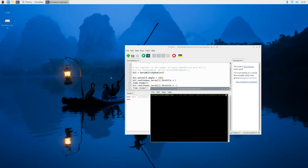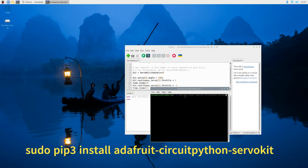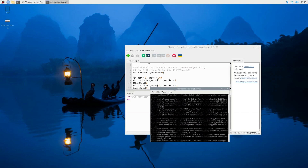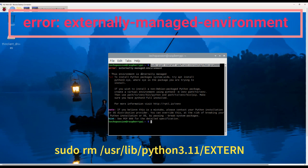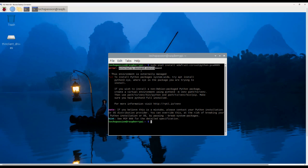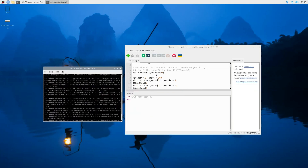I've remote-desktoped into my Raspberry Pi — I'll make a separate video on how to do that. I opened a terminal window and copied the install command from the documentation. Just type or paste that command and hit enter; it will install the library unless you already have it. If you run into an error that says 'externally managed environment,' I will leave the command line that fixes that error in the description.